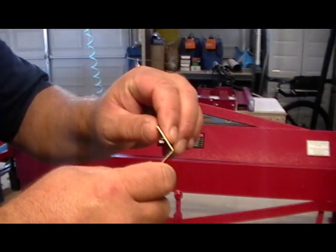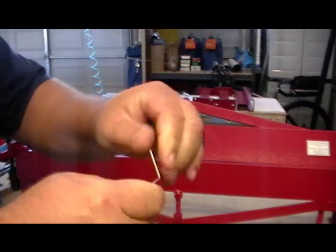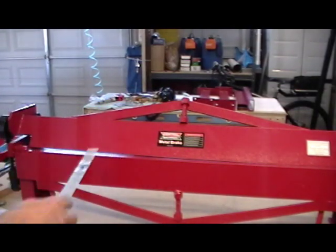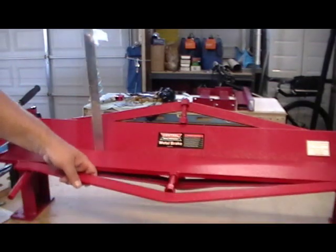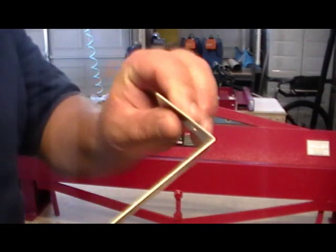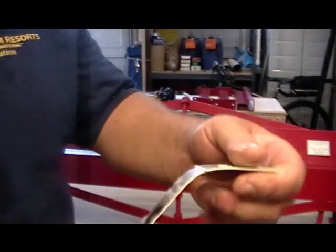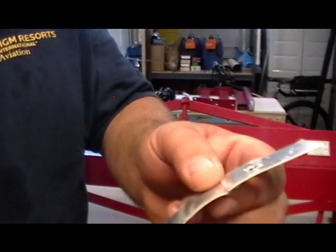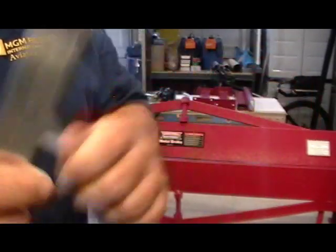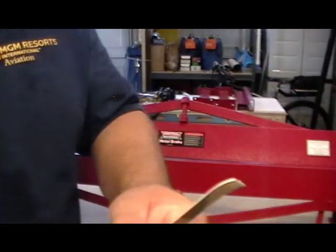Watch what happens — I'm pretty sure this will snap right off if I put a little bit of pressure on it. I'll bend another one to 90 to drive home my point. Dave's bebopping along, bends his piece to 90 or so — and if I just flex it back just a little bit, it breaks right off. The reason it breaks is because that joint was work-hardened and probably cracked too. You can see it broke right on the bend line. We don't want that.